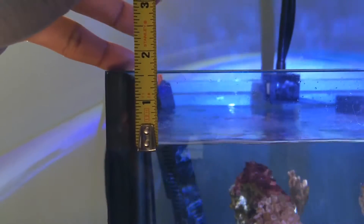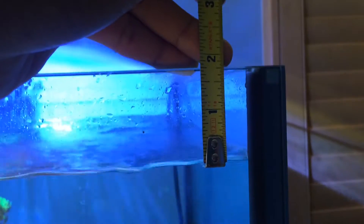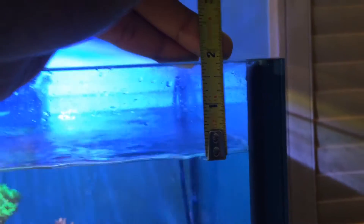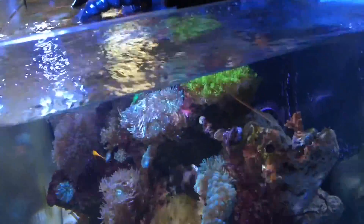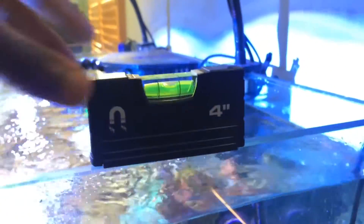On the left-hand side we're at an inch and a half, and on the right-hand side we're almost two inches — so we're off about a quarter of an inch. The tank itself is leveled, so I think it's the floor here in the middle. Let me go around to this side because I did check this when I was originally setting the tank up. Yeah, the tank is leveled but it is off, so we're going to shim it up a little bit.